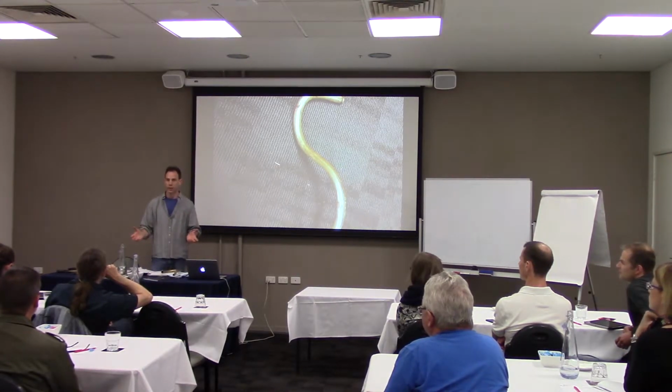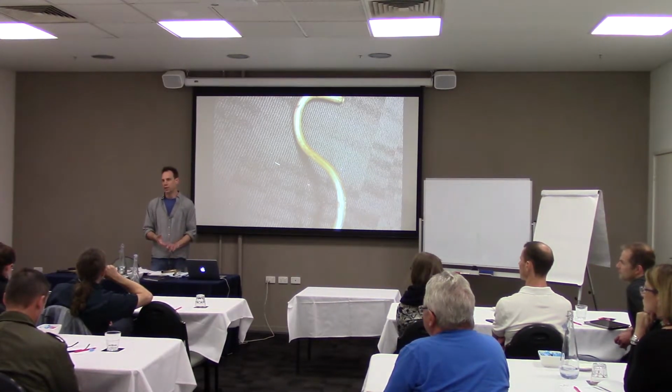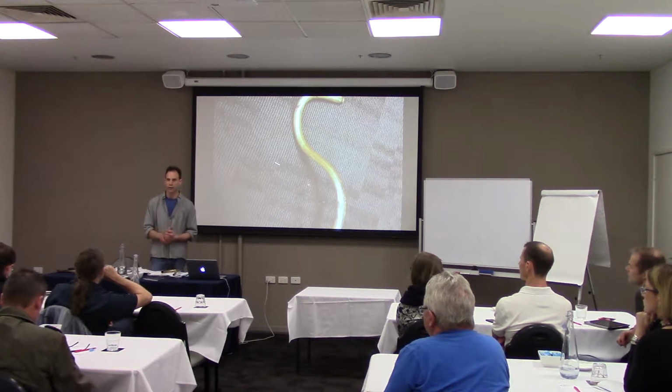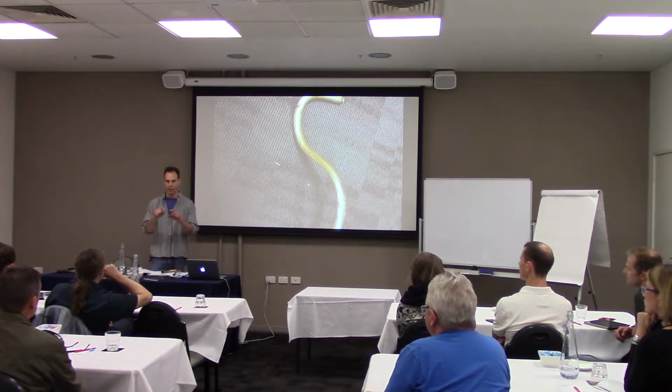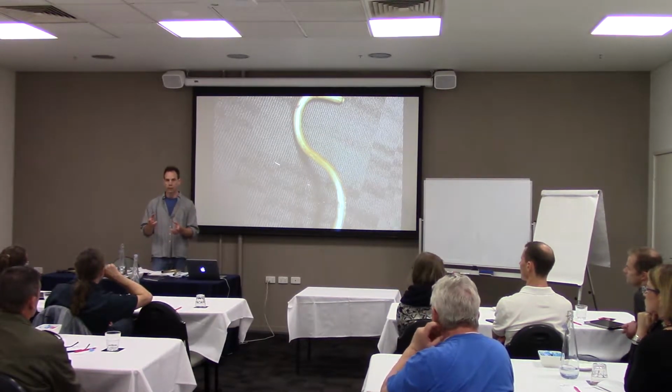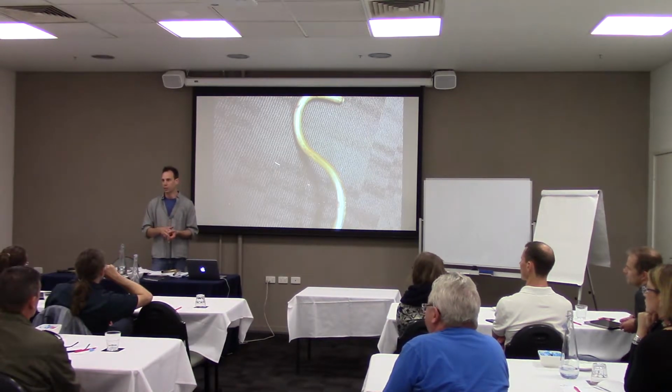If you're on your soldering bench, and you've been annealing and you picked up a little bit of lead solder from a previous thing. Have you ever had this happen? You've heated it up and all of a sudden, a hole right where the lead was. Well, what happens is the lead has now entered into the grain of the metal and it's changed the alloy. You have a new alloy at that point. And what it does is it lowers the melting temperature and now you've got a hole created because it's going to melt at a much lower temperature, it might be below the annealing point of the material.